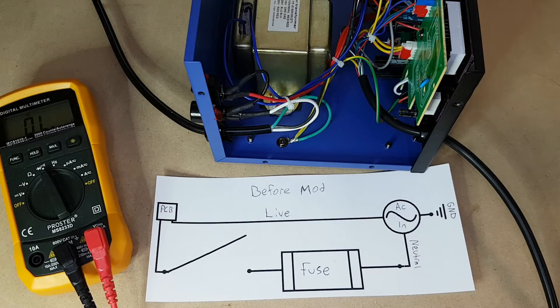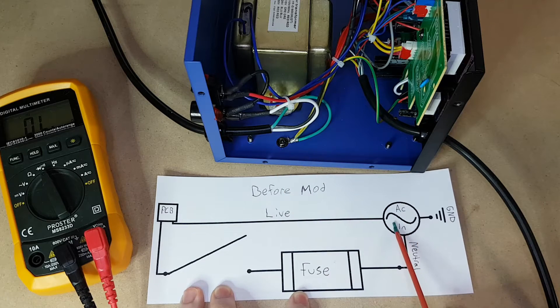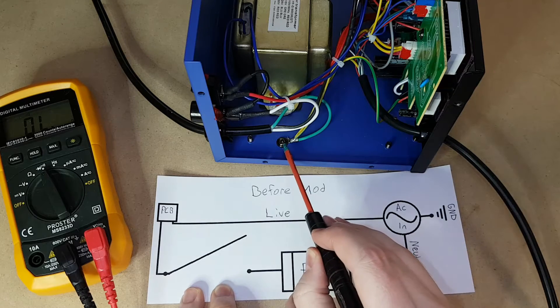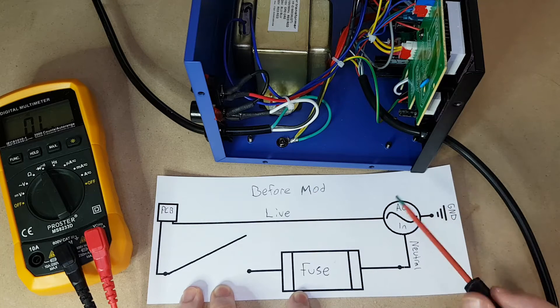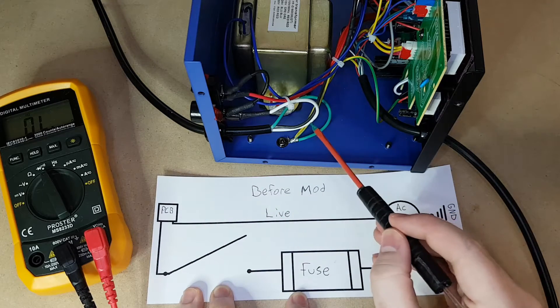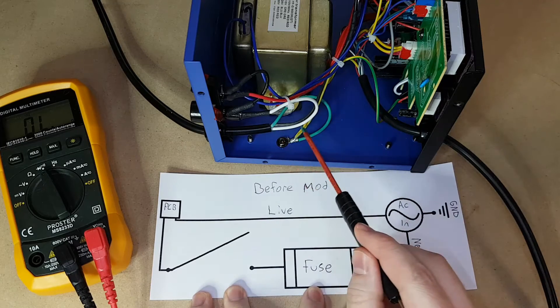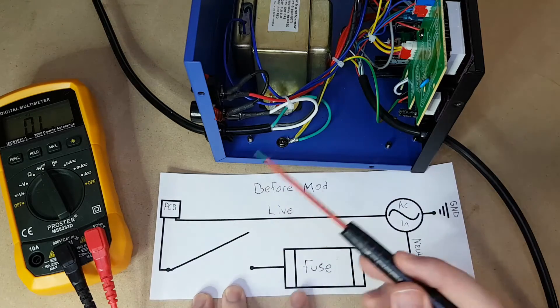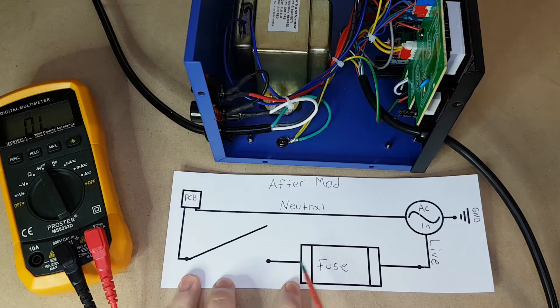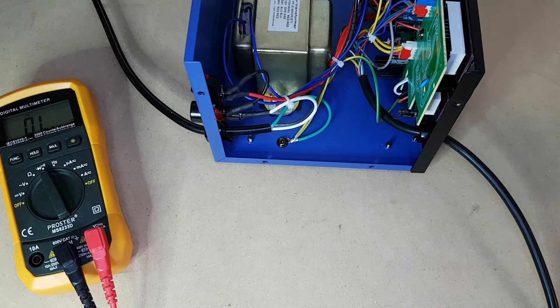I also have a little diagram done here. This diagram shows how the circuit is connected. You have the mains coming in right here, going to ground to the case, with all of the other grounds from the unit coming in here as well. You then have the live wire heading off to the circuit board — that's the black wire running off into the middle of nowhere over there. And then you have the neutral from the mains connected to the fuse, then to the switch, then to the circuit board.